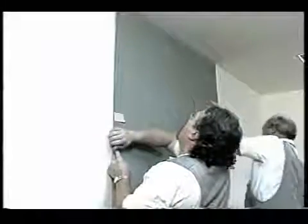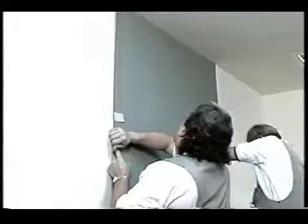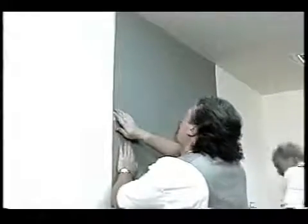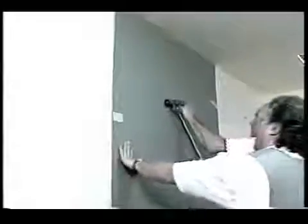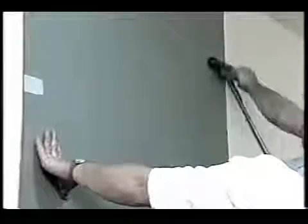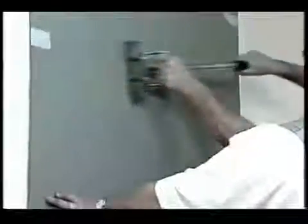In order to thoroughly glue the bulletin board to the surface, it's important to roll the material using a wall roller. Don't go lightly on this step. Put your weight into it. When working out the bubbles, going side to side is most effective because it's the shortest distance to remove the bubbles. However, you'll still want to cover the entire wall with the wall roller. First, side to side, then top to bottom.